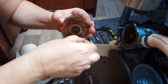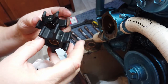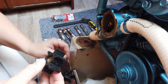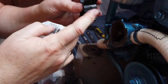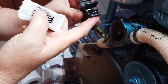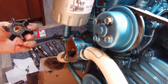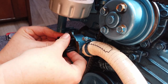Remove the old gasket and make sure to get all the pieces of the lid completely. Check if the new impeller is really the same size. Apply the supplied lubricant generously to the impeller.